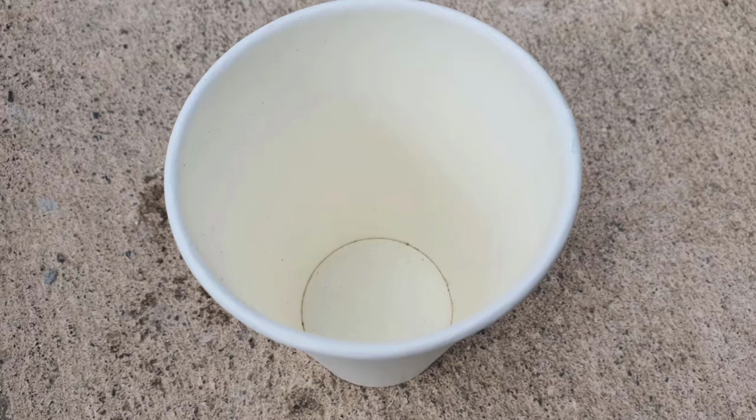This is the paper cup that goes inside our catch pot. I mentioned earlier on about the catch pot. Any excess resin is drawn through the vacuum line into the catch pot, into this paper cup, and then once the job is finished and the resin has cured, the paper cup is then thrown out. Not a very exciting piece of equipment, but one that's very important nonetheless. As I said before, this is to protect our pump because we really don't want to ruin an expensive piece of equipment.